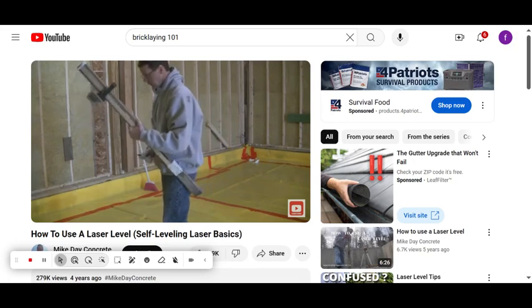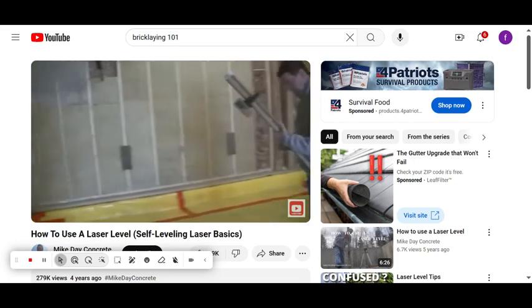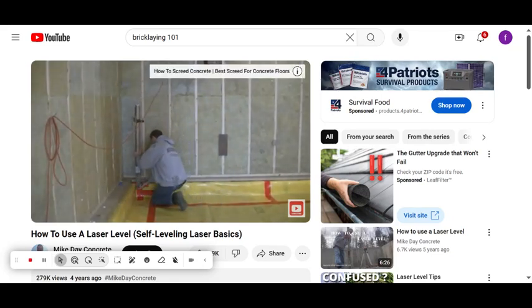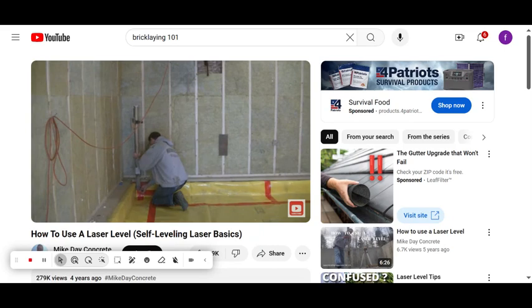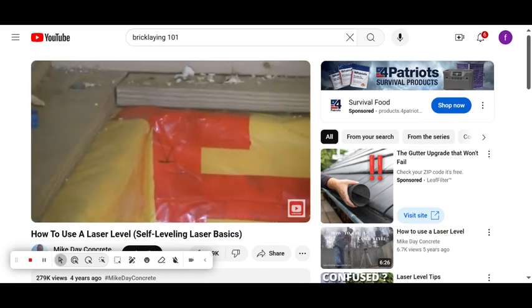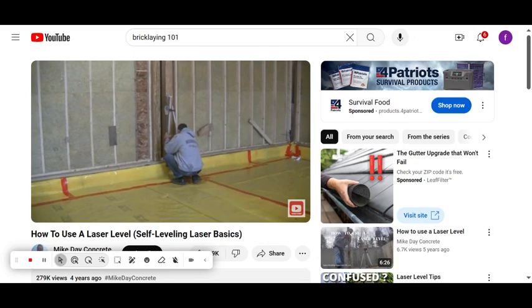In order to lower the grade, I had to move the receiver up on the stick. Now I'm going into the corner to make a mark where the top of my concrete floor will be, using the laser beam and receiver. The receiver tells me if I'm too high or too low by the beeps, and once it's perfect it beeps solid and I can put my mark right there. I can go all the way around the room setting my grade.